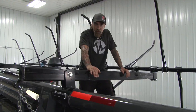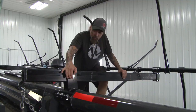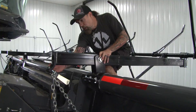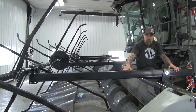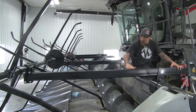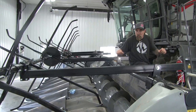4-row, 6-row, and 8-row narrow are going to use 2 of them. 12-row will use 4 of them. We find our 3/4-inch bolts, locate our 2x4, and slide it in with the piece hanging down. The back of the 2x4 has a dog leg and a 5H plate welded to it with a bolt that goes through it — this 5H bolt is how you'll fine-tune the adjustment later. Each corn reel comes with one 2x4 that has loops for running your hydraulic hoses to the motor. Put this on the side of the combine that has your hydraulics. Once your 2x4s are on, do your final up-and-down adjustment after everything is assembled, making sure you have clearance between all the snouts. On this 12-row, all the 2x4s are pretty much parallel to each other.